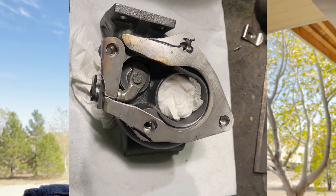I thought this might work, so I put it together and had to do some custom stuff — that's what I want to get into in this video. There's no flange available. This particular housing is actually off a Kubota diesel engine, and the only available flange is a cast iron elbow that comes off the end going to a muffler on the tractor. So I had to buy a flange, which ended up not being right, cut it up and re-weld it, and make a whole dump pipe and all this stuff.